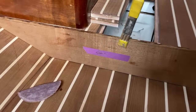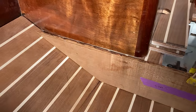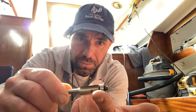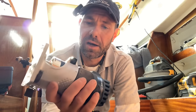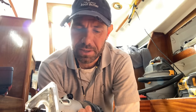Here's the front step — it's got about 6-8mm, kind of a quarter inch, sticking up on top there. Let me trim that, then glue the last piece in. You may not know what a flush cut router bit looks like — it has a little bearing on the bottom that rides up against whatever you want to flush cut to, and this bit here spins around and cuts off the excess material. I use this in my little palm-sized router — it's light, pretty powerful, does about 99% of the work I need. I do have a bigger one but nine times out of ten I use this one. It's made by Bosch — not sponsored — but it's the blue Bosch professional range. It's a nice piece of kit.